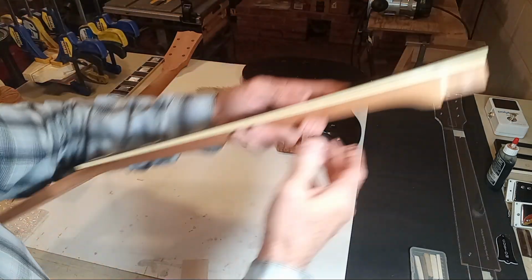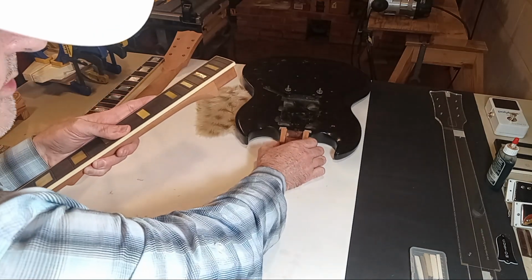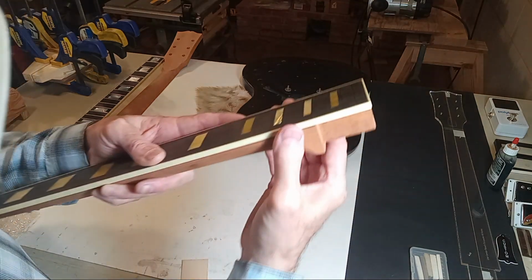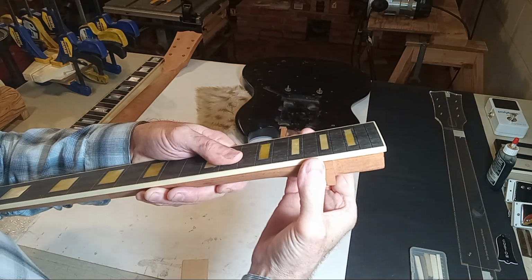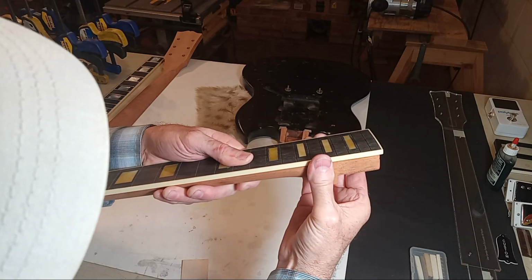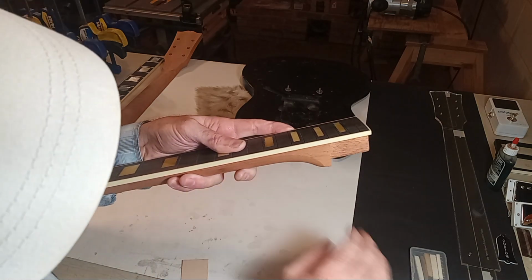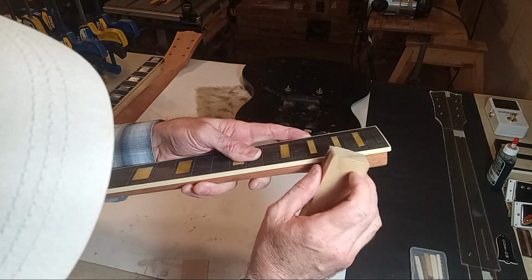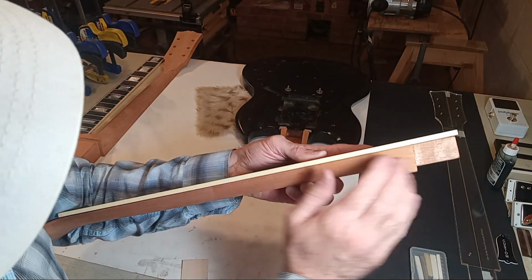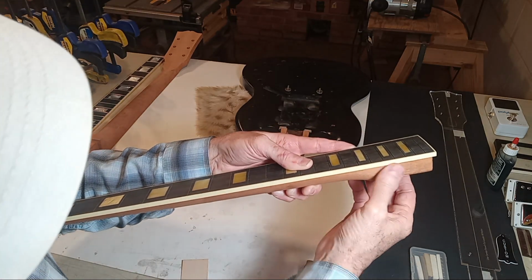then there's nothing wrong with that, because what it comes down to, if this is in a perfect world, in a guitar that has the appropriate width, and we're talking at least a 16th of an inch wider is what it really should be, then you can plan on this flushing up, and it's a beautiful, perfect world. But with this guitar, I'm probably going to be hanging over a little bit and then anticipating the thickness of the lacquer buildup, as well as, I call it a little bit of trickery, where I'm saying, if it's okay for me to shape this into the lower up here, well, then what's wrong with me doing a little bit of taper work back here just to kind of make it all blend together?